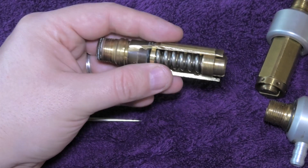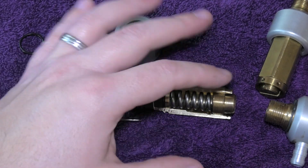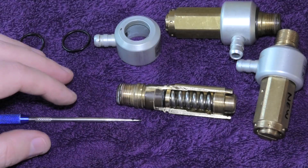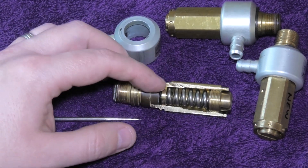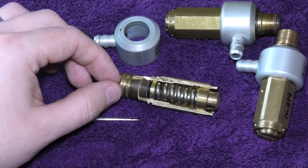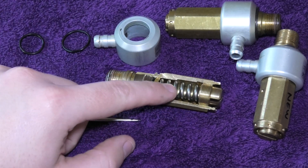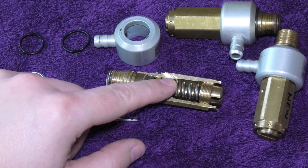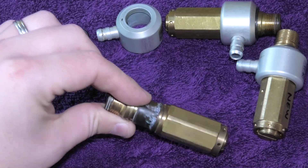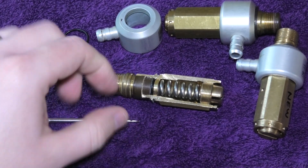If you spoke to Dual Pumps or anyone like that, they would say don't touch these unless you really know what you're doing. I'm sure there are other videos on YouTube which show setting these up alongside your unloader valve with a pressure gauge. Because if you wind these too far in or you back them out too far, you're not going to get full pressure and the machine's going to cut out. If you've got a 200 bar pump and you wind this in too far, it's only going to cut out at 250 — you'd need a lot more pressure before this thing would activate. That's why they probably don't fit these to lower pressure machines. But if you have got one of these on your machine and you're experiencing hesitation in the trigger — pulling the trigger and it cuts in, cuts out — this will be the first place to look.